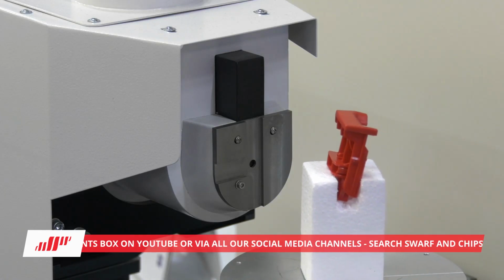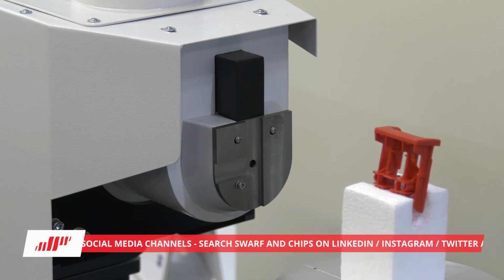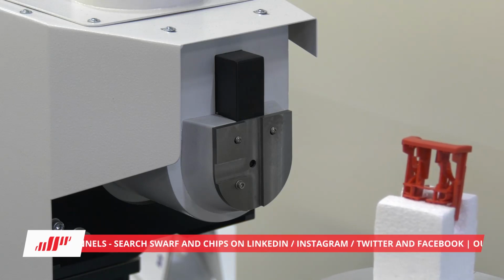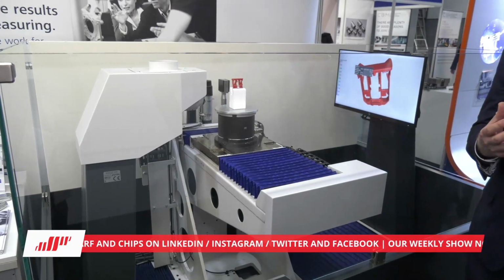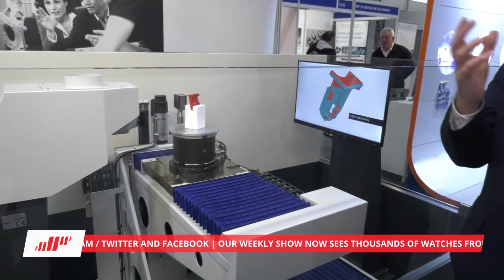Okay. So when you're interested in understanding the internal structure of a part that's been 3D printed, you don't have direct access to what's going on inside, so you can't see what that internal structure is. You need a technology like CT that uses X-rays to penetrate through, see the internal structures, see the internal defects, and model that in the same way as you would with a conventional CMM system.